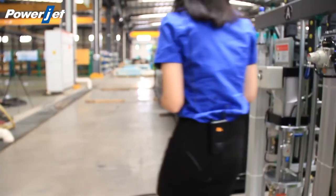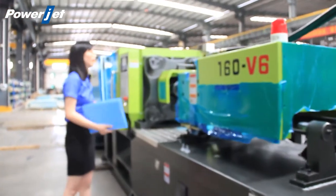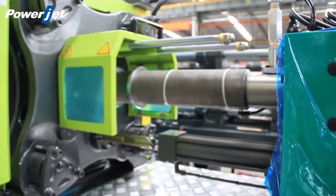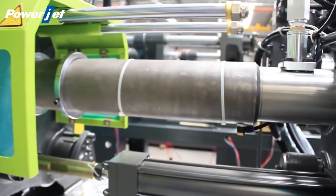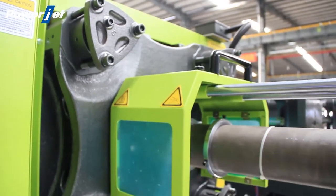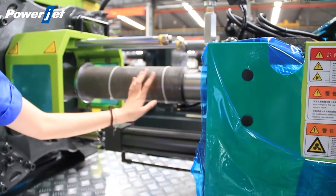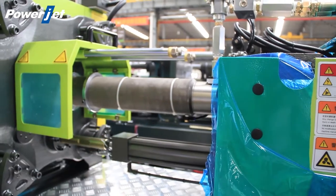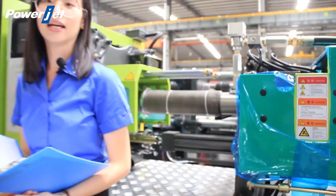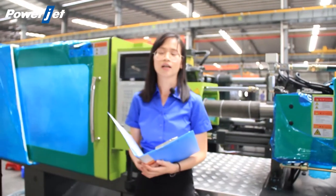The raw material will meet in this tube and then get into the barrel of the injection machine. The screws, especially developed for silicone, will make them blend well. After the charging process, the machine will inject automatically. There are no heater bands on the barrel of the silicone injection machine because, different from most plastic materials, silicone material will be formed after being heated at high temperature. So we need to control the mold cavities and mold temperature on the machine.